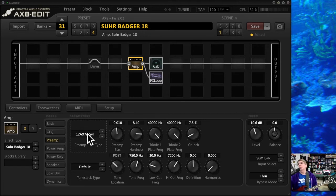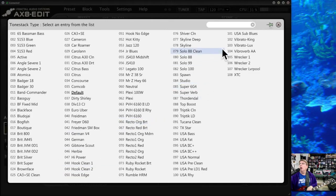On preamps, you can fool with the tube types. I tend to leave them alone, but sometimes it's fun to play with a different preamp tube — this is sort of a Mullard-Marshall thing: old Sylvania, old RCA, more modern JJs. You really want to get experimental and fun, and this can sound terrible or great. There's also a tone stack type, and you can look at all these different tone stacks you could put into this amp and it'll sound different.